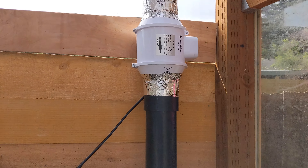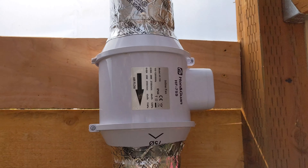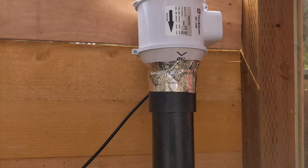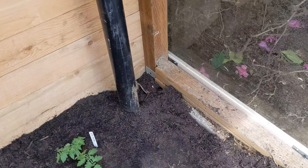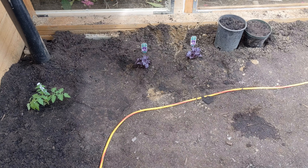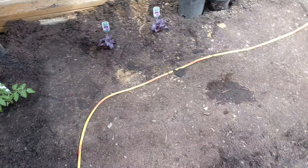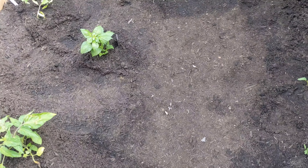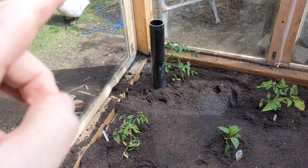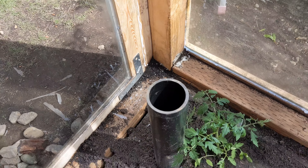This pipe here is our intake valve. We have a three-inch ducting fan basically pulling air from the hottest area up here of the greenhouse, which pulls the hot air down into the ground. In the ground we have six eight-foot long drainage pipes, which is basically taking that hot air and warming the earth underneath us about four feet down. That warm air goes into the dirt while cool air is sent to our exhaust port right here — if you put your hand over this you can feel a nice cool air coming out from down below.